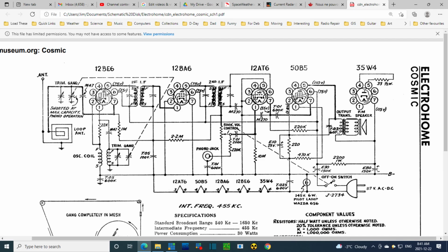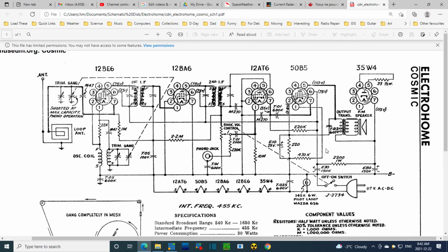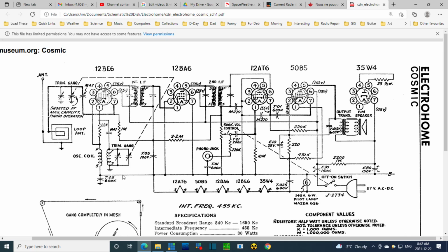There's only a few left in here. Let me just look under the radio for a moment. One, two, three, four. Four of them. There's four tubular capacitors, so with a T in front of them like this one. So there's one there. Some of these I've changed. There's one here I haven't done anything with. There's one here I haven't done anything with. That's one, two, three. And the fourth one is somewhere in this radio. Here.